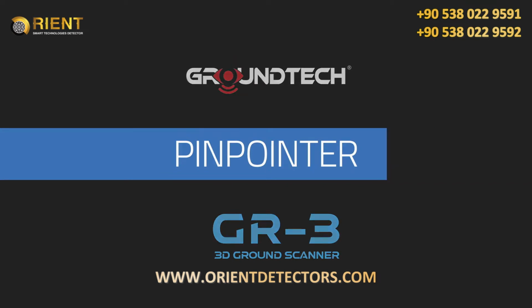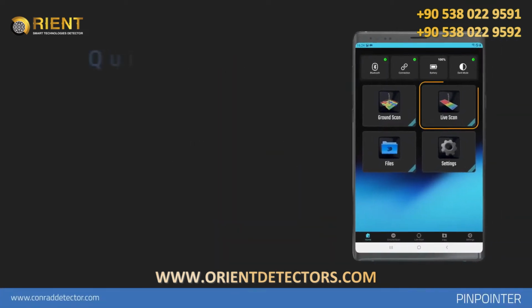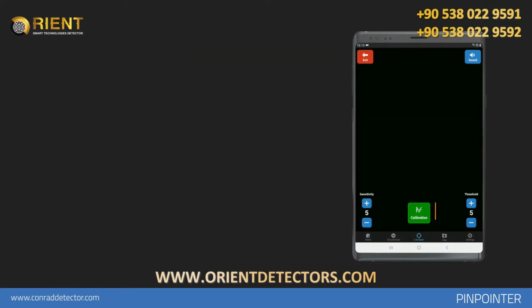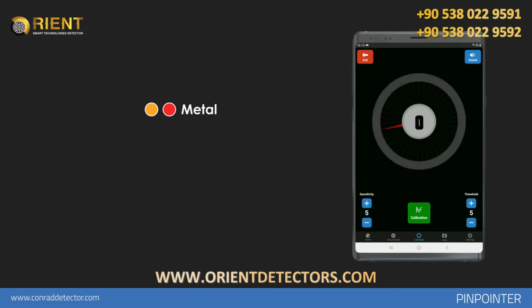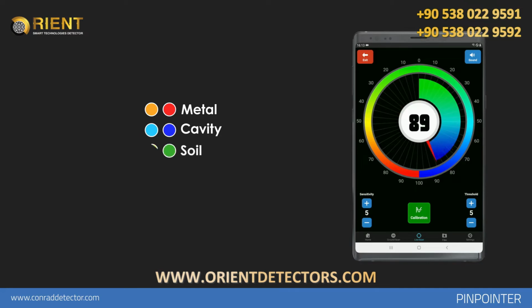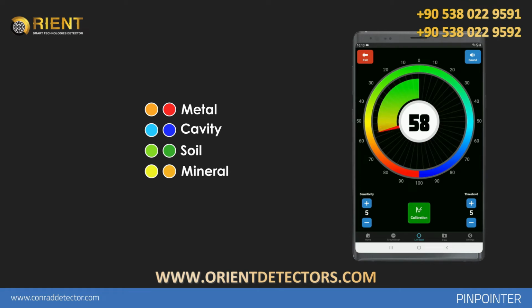Pinpointer. You can use the pinpoint option to determine the exact position of the metallic or magnetic object you have detected. Before starting the scan, by touching the calibration icon, you can reset to ground level in an area different from the target point. You can see the severity of the signal and graphic bar according to the type of object in the middle. When objects with magnetic effect and metallic objects are detected, the bar will increase to the left side. The bar will increase to the right side when structures such as cavities and caves are detected.